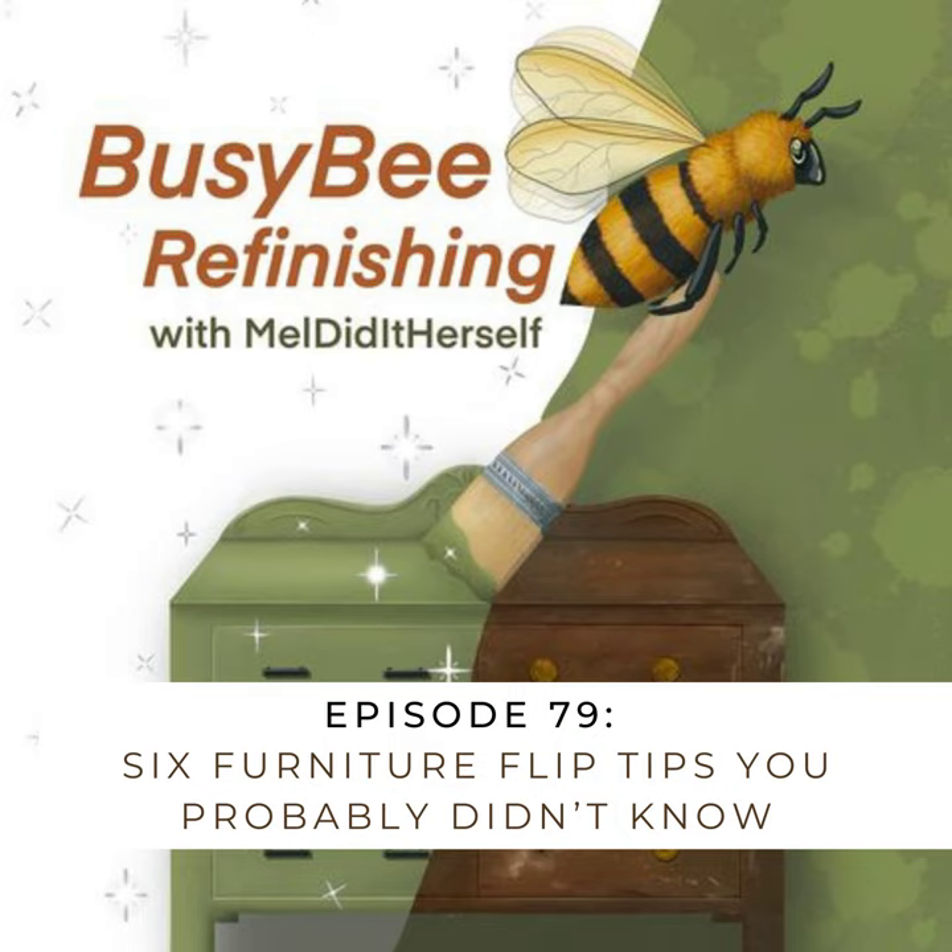Hack number two is my personal favorite. I have a deck of playing cards that I keep in the workshop, and I basically slide them underneath the lip of the frame surrounding the glass or mirror — put them in lengthwise and create a border around the openings of the perimeter. Then just paint as normal. You're going to get paint on these playing cards, so don't use any collector's items. Pull them out before the paint is fully dried to avoid any peeling, then let the cards dry before putting them back in the deck. You'll have zero paint on your glass or mirror.